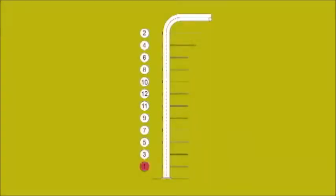Tension in sequence, beginning with the outside cables and moving back and forth toward the center. Finished cables should be tensioned to have only 1/4 inch of play when finger pulled.